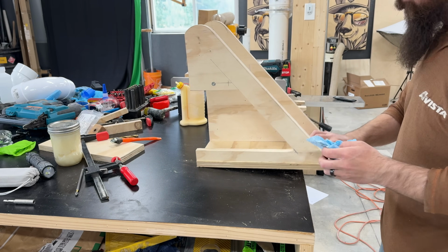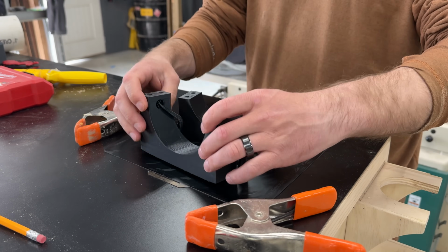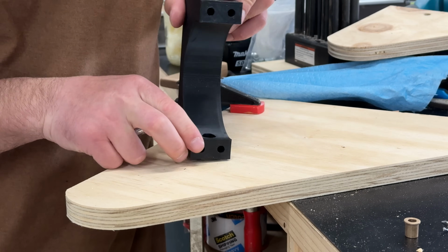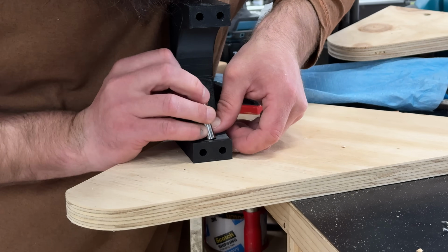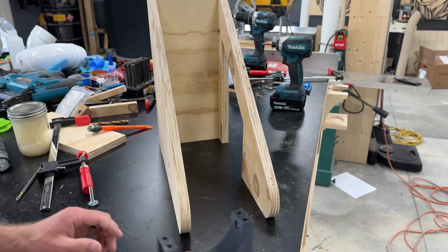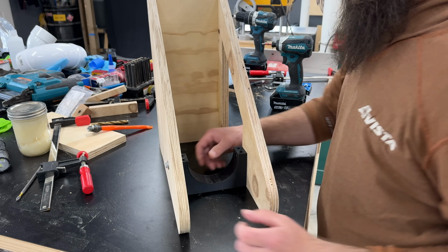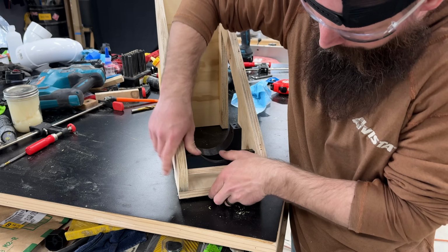In order to make this arm rotate up, I designed and 3D printed a hinged pipe clamp. The rotating axle consists of 2 ¼ bolts and oversized holes in the lower half of the pipe clamp to receive brass bushings. This will prevent premature failure with use. The clamping action uses 4 6-inch ¼ bolts to allow the 2 halves to bite down around the pipe. Honestly, 4 is probably overkill, but I like the symmetry.